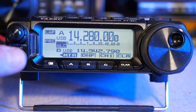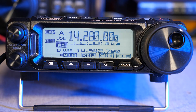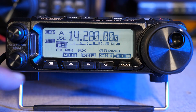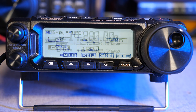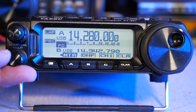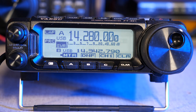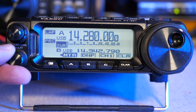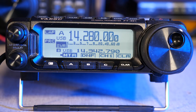Now when I press meter, I can easily select those meters. Another neat thing is if the meter is highlighted and I just rotate the multifunction knob, it automatically selects the meters. So if you find you need to quickly switch between power, ALC, or SWR, moving the meter function to one of the hotkeys and activating it makes it super simple to make those selections just by rotating the knob.